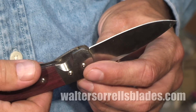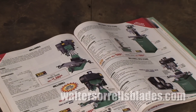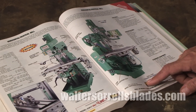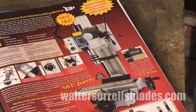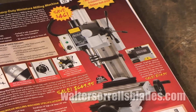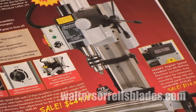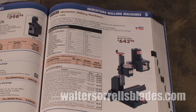Figuring out which one to buy is quite a minefield. Here's a survey of the basic types available. The smallest mill is the mini mill — as the name implies it's a benchtop item with a very small motor. Mini mills are primarily used by people who make models, model steam engines, model railroads, and things like that, but they can also be very useful for knife makers. Sherline and Micro-Mark are well-known specialists in these tools.